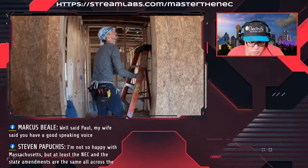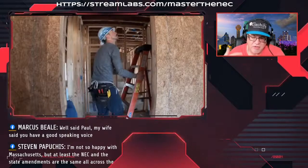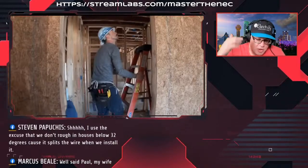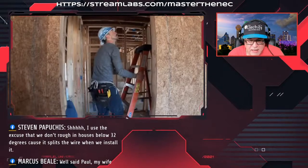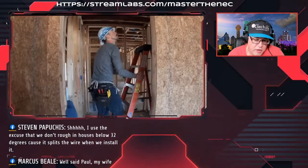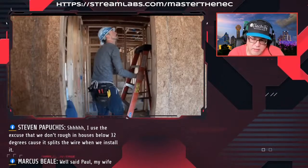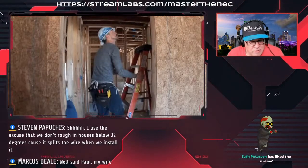But one thing to be aware of is when it comes to NMB, as you start taking it through bored holes, and if you happen to come in contact with thermal insulation, like might be in an attic, as you go through bored holes or over top plates when you're coming down into a panel, you've got to be careful, because when you start getting more than two cables with two or more current carrying conductors, then you have to start doing some adjustments and things like that. So have to be aware of that.